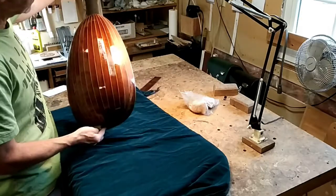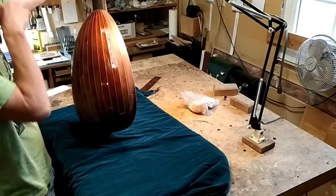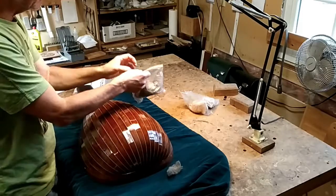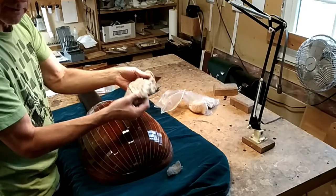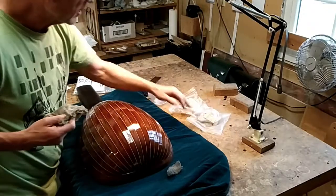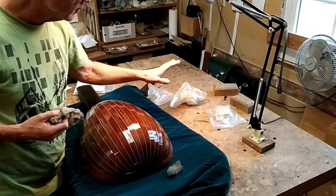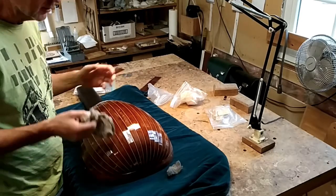Okay, well there are two ribs that are done. I hope you can get a look at those. I won't bore you with the entire back — this will take me about ten minutes to do. Then I'll rub the entire thing down with this, which is a tack cloth. You can see it looks kind of gray — it's my dedicated tack cloth for wiping off steel wool. Before I apply varnish, I've got a couple more tack cloths that I use to remove dust from the back before I actually apply the varnish.